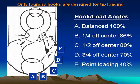Hook/load angles. In the example shown, A balanced 100%, B 1/4 off center 86%, C 1/2 off center 80%, D 3/4 off center 70%, E. Point loading 40%.